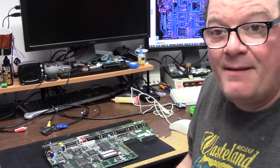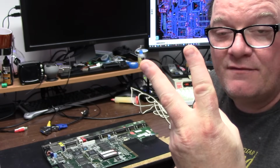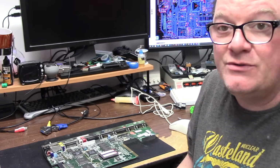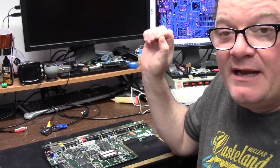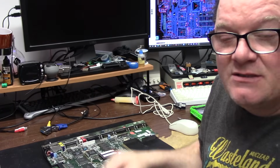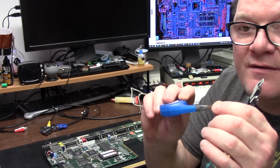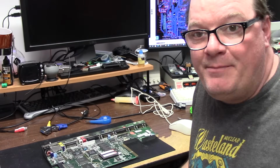But I cut my caps and I peel the aluminum. I snip the 2 teats that are left over from the legs, remove the rubber, and the plastic piece pops off. You've seen it before on my channel, but I'm reiterating for those who may be joining us for the first time. Then I take a soldering iron and I poke the leg, get the remaining legs off of the pads, and then I flux and braid remove the leftover solder and clean it up with IPA.